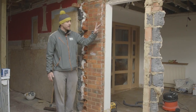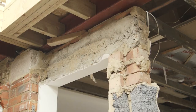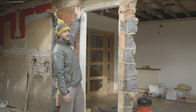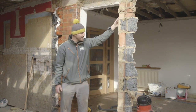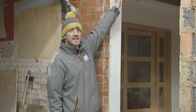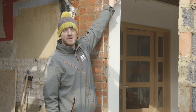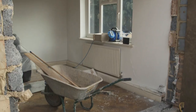Where this wall has come out, we found what looks like a self-poured concrete lintel, which is where the old back door was. We can't take this out because it's sitting into the supporting part of where the steel sits. So we've got to nibble it out here, then we can take this out, which will then mean we can take this out - creating the completely open plan living space. There are two ways of taking this out: we can either use a grinder, which is fine because we haven't got the lantern on yet so the dust can escape, or we can just stitch it out with a drill bit - a six or eight mil drill bit - literally stitch it out all the way up there, and that will release it to come down.